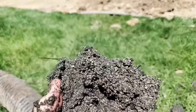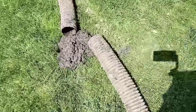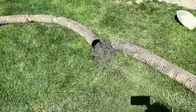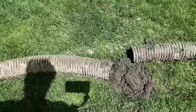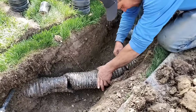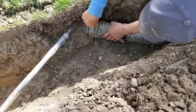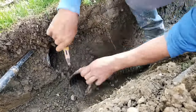People are allowed to do this horseshoe shape instead of a deeper dig where they take it out further and daylight it — it's not this U-shape you want. You want to dig it underneath the walk and then go out, down, and just keep digging until you daylight further down in the slope. Yes, it takes more work, but the results speak for themselves. It's the difference between having a roof runoff system that lasts forever and a system that's going to fail you — ending up with a flooded basement or crawl space and having to redo the system because you didn't put in an inline catch basin, a cleanout at the house, or a pop-up emitter you can get your hand in.